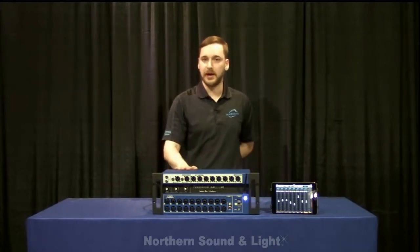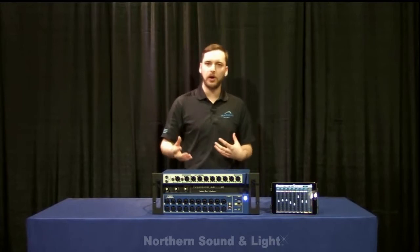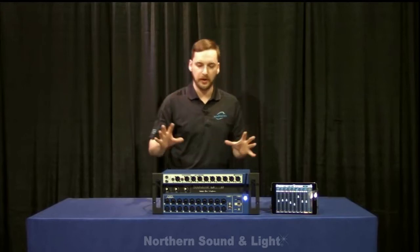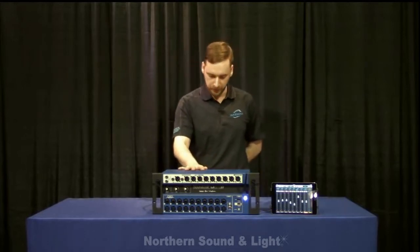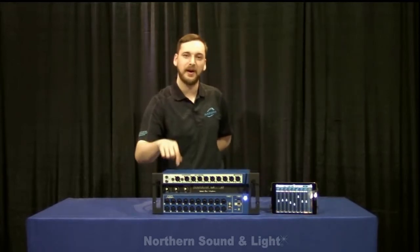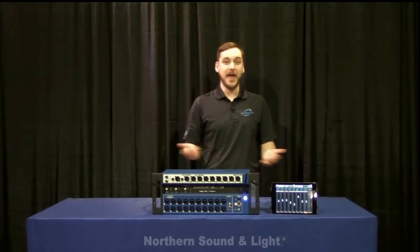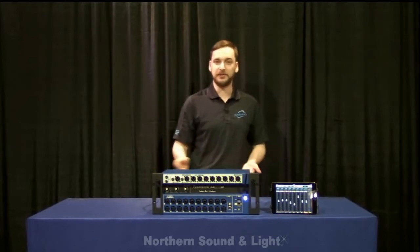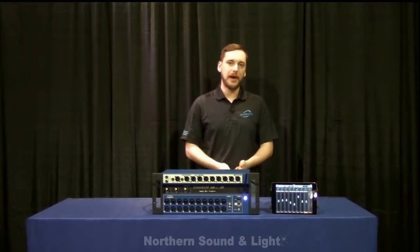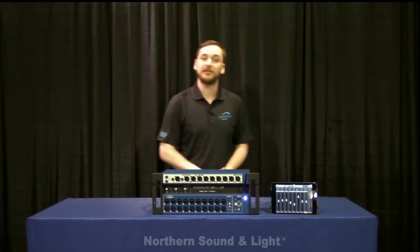You have four channels of Lexicon effects. Those effects can be chorus, delay, or reverb, and you can switch between different types — whether you want a more analog warm delay, a slapback, or a really thick chorus — with multiple parameters to control on each. As a guitar player, one of my favorite things is the two channels of Digitech amp modeling. I run into situations where a friend wants to plug in and jam — it's as easy as plugging your guitar right in. You set the high-Z impedance to properly load down your guitar pickups and you can call up a Fender, Vox, Marshall, whatever your classic amp of choice is.